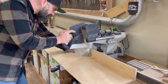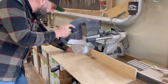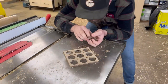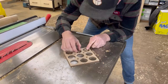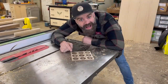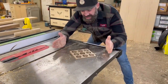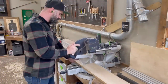Next, I needed to just slice this thing up like a stick of salami, and I should be able to wedge all these pieces into my test piece of white oak. Pretty soon I had a number of these perfectly symmetrical walnut stars, and now all I had to do was set them in place. The key is when you mill up your solid walnut stock, you have to make it exactly the same width as the diameter of your hole. Since I did an inch and five-eighths and my stock was an inch and five-eighths — what do you know, it fits, and it looks pretty darn good.